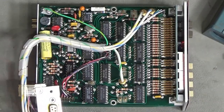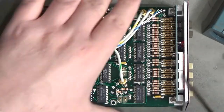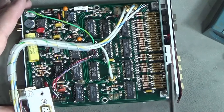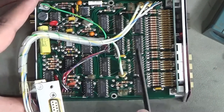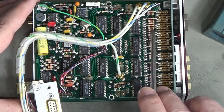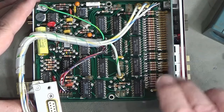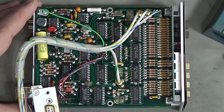Switching to top view - on this side we've got the seven-segment displays and a few LEDs on the display board, then all these resistors current-limiting into those seven-segment displays. We've got a bunch of 74 logic, and these are primarily BCD to seven-segment decoders - three of them will be BCD to seven-segment decoders for a three-and-a-half digit display.